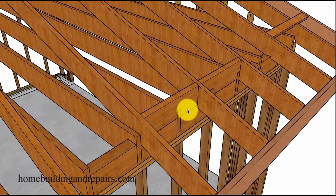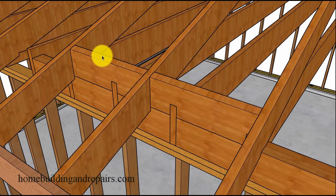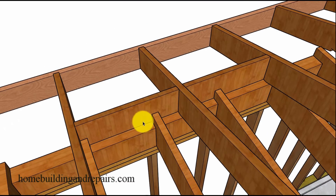Another thing you might need to do is put some type of blocks in here, and if possible, shape the top of the block. I realize you won't be nailing the sheathing through the blocks because the roofing is in the way, but if you ever go to re-roof the house, you could nail it then. Whether or not you shape the top of the block I'll leave up to you, but these blocks will be beneficial for the rafters, and you can toenail everything together.